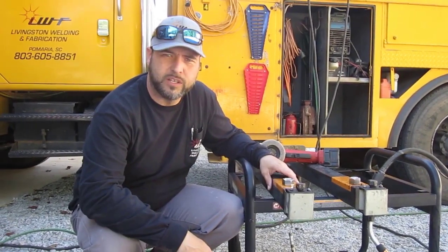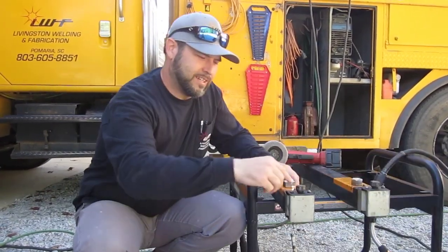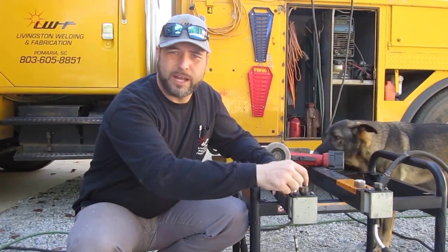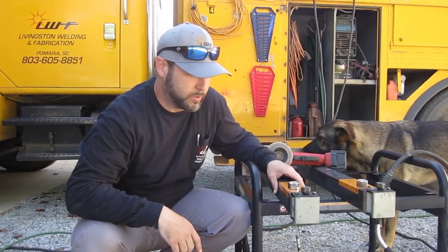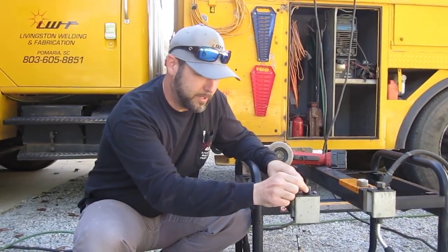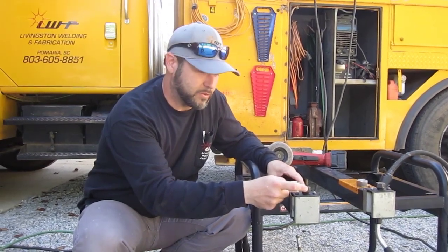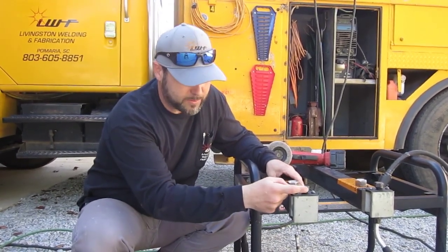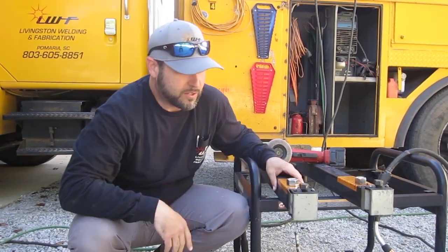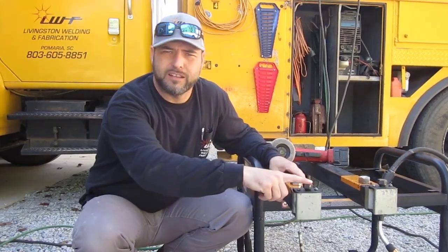they're pretty slow. So the customer had welded these nuts on here so he could use an impact to run them up and down a lot faster, which everything's fine with that. The problem is, I think maybe when he welded them, they got too hot and it took the temper out of the nuts, because he's only used them a couple times and it's already starting to round the corners off real bad from the impact. So I'm thinking when he got them hot, it took the temper out.